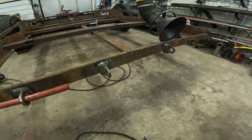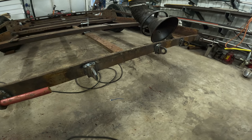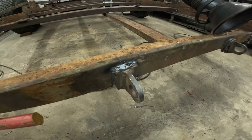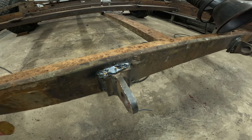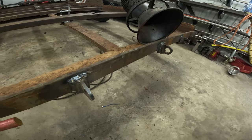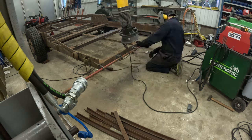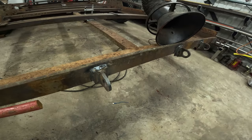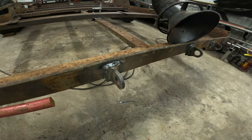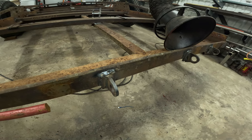This old steel, or maybe the old paint, the old coating, is not fun to weld in, but this weld, yeah, this is the second try. And I actually think, if you look at the video now, I know it's a time lapse section, but I actually think I had the exhaust fan too close, because when you get a draft, you can end up sucking the shield gas away. So I'm going to try to grind this away and re-weld it again, and then have this further away. So let's see if that works better.